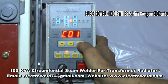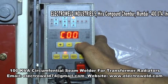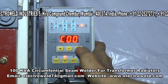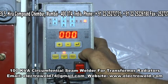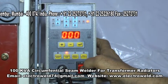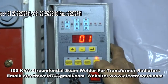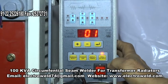Then enter again. C2 just keep at one cycle. CYC 0, SLP 0, heat 0, hold cycle keep at 10 cycles, half cycles 0, impulse 0. Now this setting is set for welding 1.2 plus 1.2 thick MS sheet. Switch this on — this is the weld/no-weld indicator. Then you can start welding.